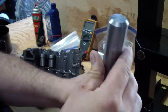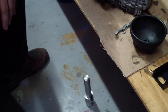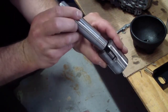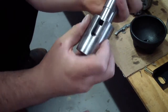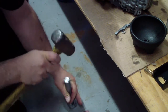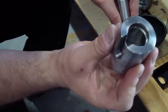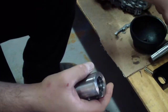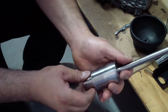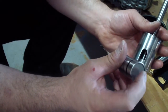So I put this — it fits all the way in — and then I beat it with the hammer. It will go all the way in and it will straighten it up. I don't want to beat on the table and have all the parts go everywhere, so once again this will go inside and it will stop at the register. Push it all the way in — it's rounded perfectly. And this thick shim helps prevent any damage to this part.